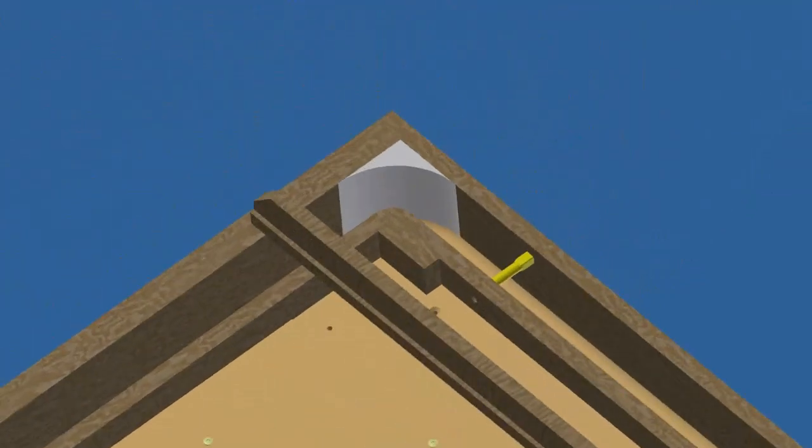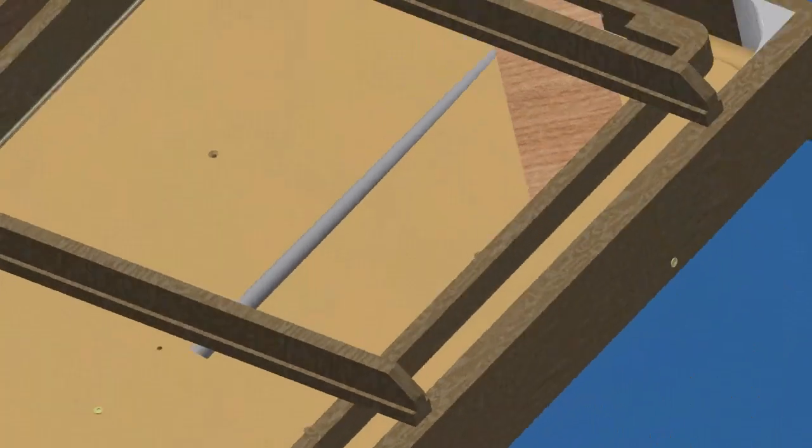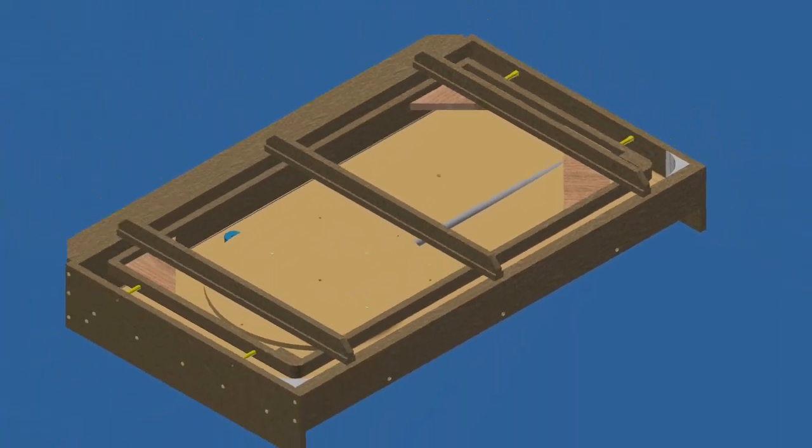This disc is what will hold the anchor bolts that will be inset into the concrete. Looking at one of the front corners is a cove that I printed on my 3D printer. The yellow and the blue plugs also came from my 3D printer. This cove allows for a nice rounded corner at the front edges of the countertop. Here is a grey plug glued to the base of the form — this plug forms a drainage channel right down the middle of the countertop. That's the quick summary of the form and now let's get to showing how it is assembled.